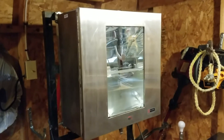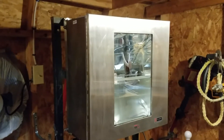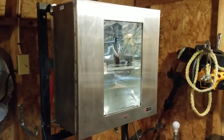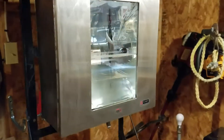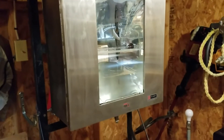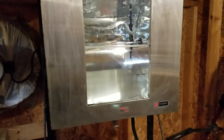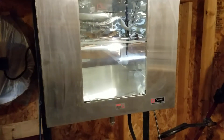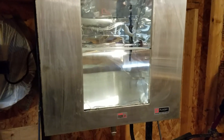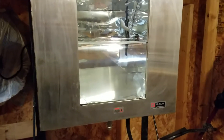What's going on everyone? This is going to be a video on the Flash Technology FTB-205. This is a high-intensity obstruction light. Typically these lights are mounted around over 700 feet in groups of 3 or 4, depending on the circumference of the structure. This is the FTB-205-10, the newer version being the 11. The biggest difference between the 10 and 11 is the 11 comes standard with EagleSmart. For this unit, if you want EagleSmart diagnostics, you have to upgrade the timing and trigger board.